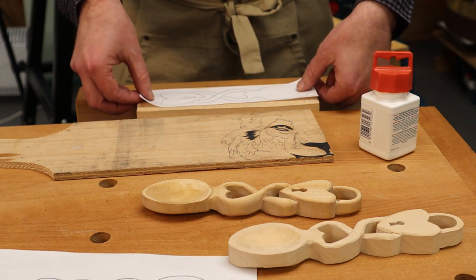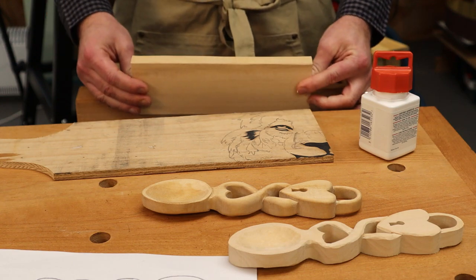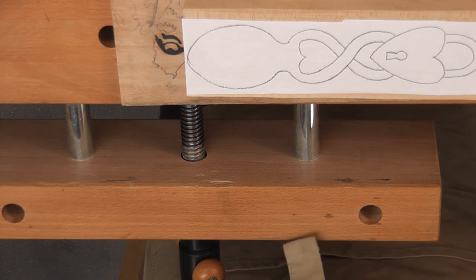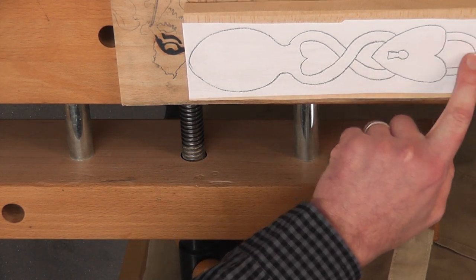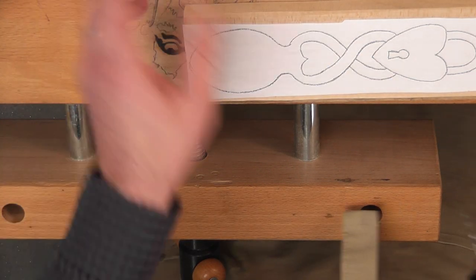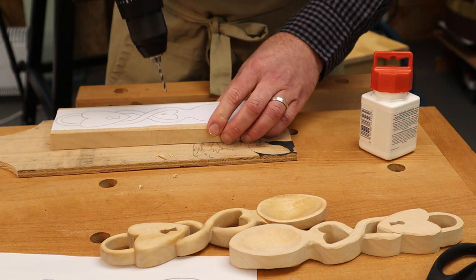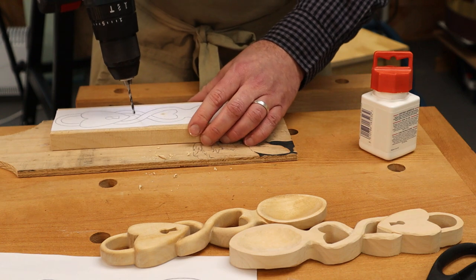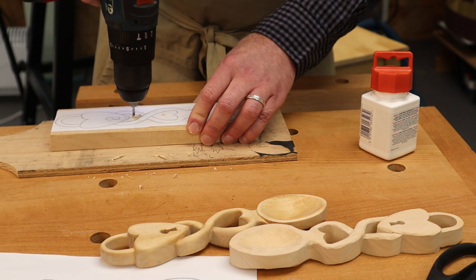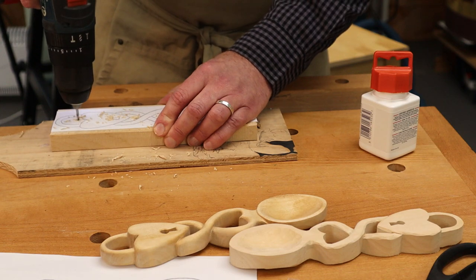Our template — this bit of lime is about 20mm thick, just under three-quarters of an inch. We need to drill into each of these captive areas on our love spoon because we want to cut them out so they're all nice and hollow. We need to keep the drill bit nice and straight as we go down. I've got a little board underneath — it's very thin so I don't want to drill into my bench.